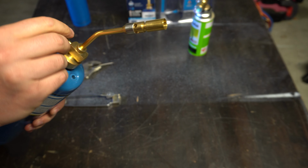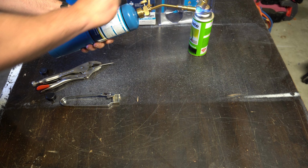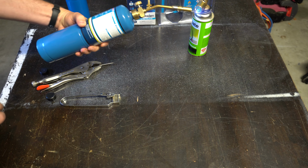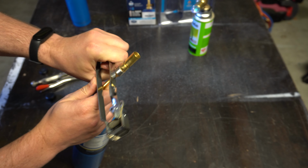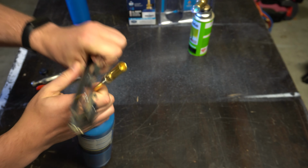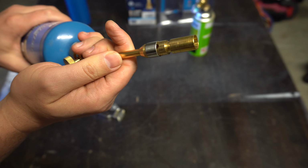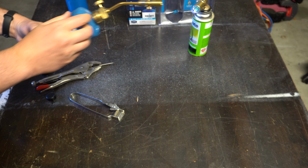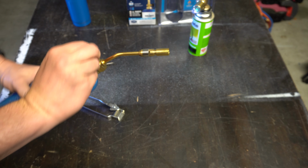But unfortunately it made the flame very unstable. You see, it doesn't light up. Too much air in the mixture. So then I made this small ring that can slide on and off to adjust the flame to be the best. So now I cover it about half by half. It already works, but you see it's still very unstable. Tiny blow of wind, of movement, and it dies.